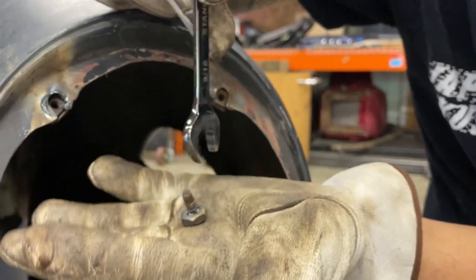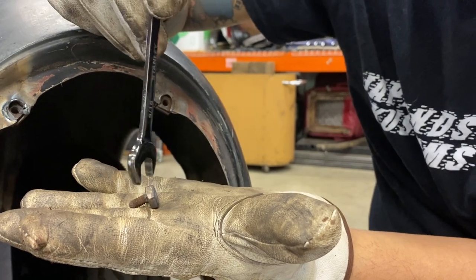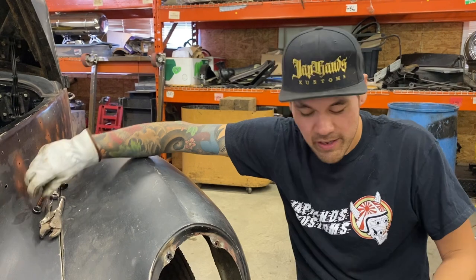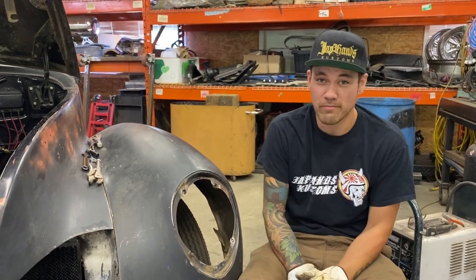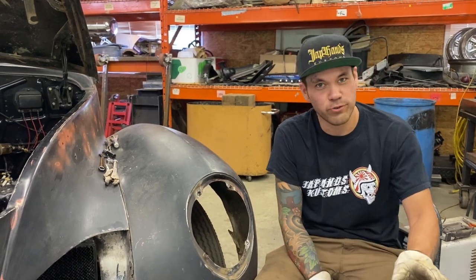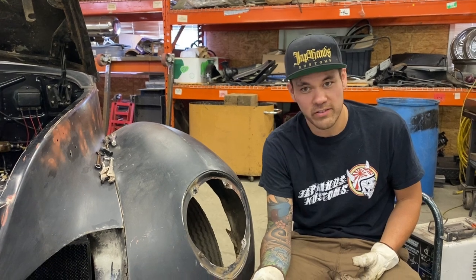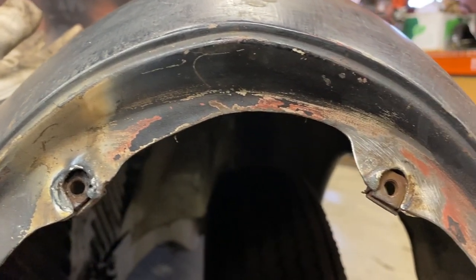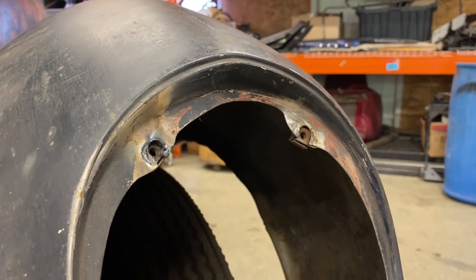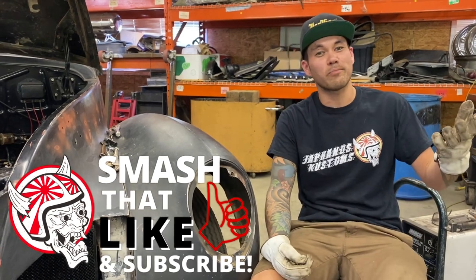That's hot! There you have it — the hole's still good. We made a nice little bolt you could reuse — just kidding, that's garbage. Or for the wall of fame. There you have it: two different ways of removing studs, one with the MIG welder and one with the TIG welder. I've used this countless times. I hate drilling out studs — it's messy work that usually ends up messing up the threads. This method, if you have the space to get in there, is the best way to remove broken or seized studs, even on delicate stuff. We didn't even bend the tabs on the cage holding those nuts. This is a great tip — I hope you use it. Thanks for watching Make It Custom, don't forget to like, subscribe, hit notifications, and tell your friends. Have a great day!